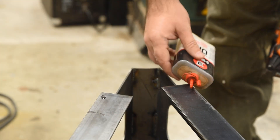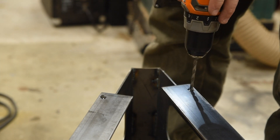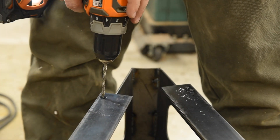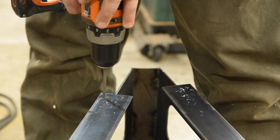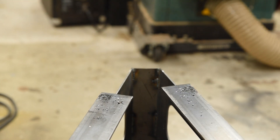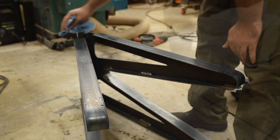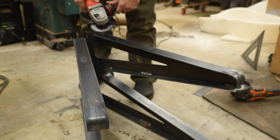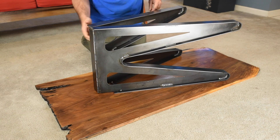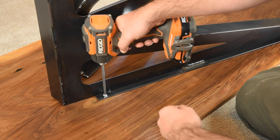To be able to secure the base to the top, I drill some holes through the strapping. The farthest screw holes are only about 16 inches apart, and across that kind of distance there fortunately won't be very much wood expansion — and even more fortunately, that lack of wood expansion isn't going to disappoint my wife. I sized the holes about 50% larger than the screws anyway to give them some room to move. After it's drilled, I wipe up the cutting oil with some alcohol and take some quick swipes with a flap disc on the angle grinder to remove any burrs. Off-camera I wipe down the base and then sprayed it with some clear lacquer to keep it from rusting. I use some self-drilling hardwood screws with washers to tie the two together and then stand it up.